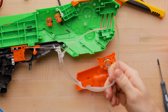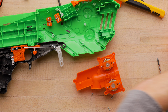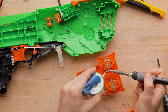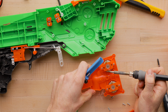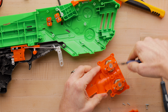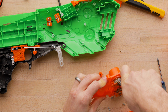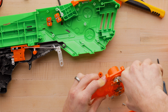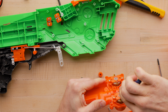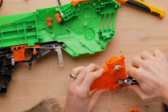I had to pause to grab safety glasses — always wear safety glasses when you're cutting or soldering. I also grabbed a solder pump because there's a whole mess of gunk on here and I can't clip it off like I might normally. I'm going to try snipping off that gunk instead of melting it off, because it's coated in plastic to help it stay in place, and I assume to somewhat waterproof it. There's some sloppy soldering on this blaster — they've actually hit the shell in several places inside the cage.